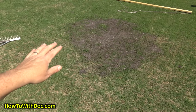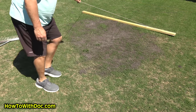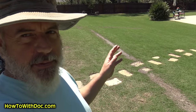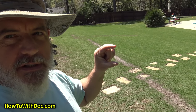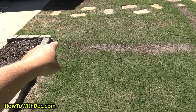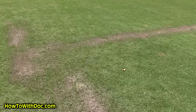We've done this big area which has more of a dip than a defined rut. We spread it all out with the rake and now we're checking our work with the board — and that's pretty good there. Yesterday we also started on the back. You can see this line here — it was an old irrigation trench that had gone down an inch and a half. And this line here is where some idiot installed a sprinkler head, so we moved it back, and that soil settled about an inch and a half as well. Down here you can also see another irrigation line that was settling.